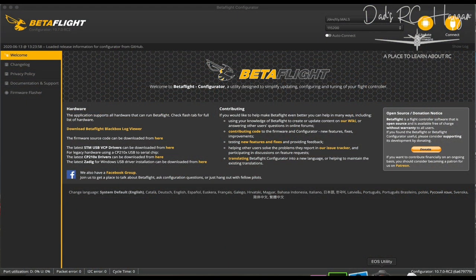Okay, so I've opened the Betaflight up. I'll leave all the download links, and also I've got BLHeli, that is for ESC setup, and also for updating ESCs, which we'll go through in another video. There's a lot. I'm just trying to quickly rush through this so it's not spending a billion years. So I've got my quad plugged in, and you should see here, when it comes up USB modem, you know that it's ready to connect, and press connect.